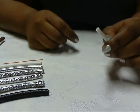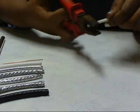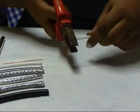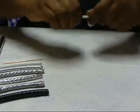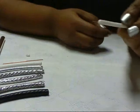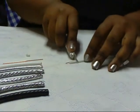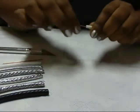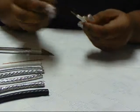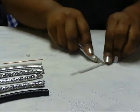If you're looking to get straight down to the core, it's not too hard. You can use your wire cutters - what I like to do is just spin it a little bit and cut down a couple times but not all the way down, because it might mar the outside of the copper. You can also use your pen knife or exacto knife, as you're at least less likely to put a mark on the copper. If you don't want to strip it that way, you can just take the whole thing off and do that a couple times - I'd just recommend doing it in smaller pieces.